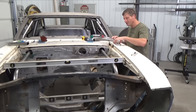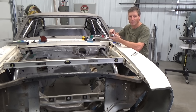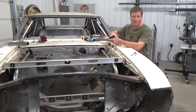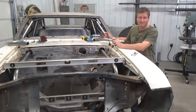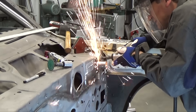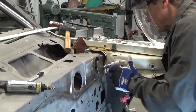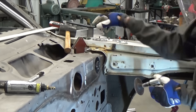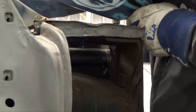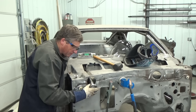Next, I'll trim my connector bars and weld them to the flanges. But these are in a tight spot, so getting to the back to weld them is going to be pretty difficult. I'm going to take my MIG gun and tack them into position first, then pull it out and TIG weld it on the bench. The flange is about three-eighths thick and the tubing is 0.083. I auto-set the Multimatic to quarter inch to make sure that I put down a solid tack.